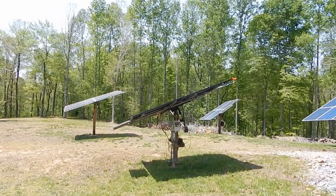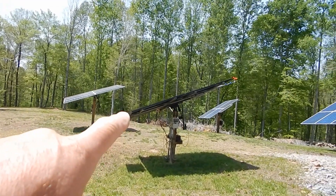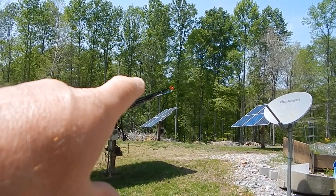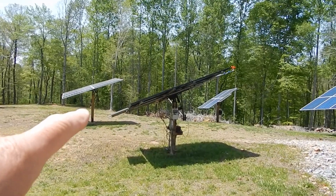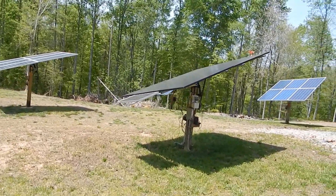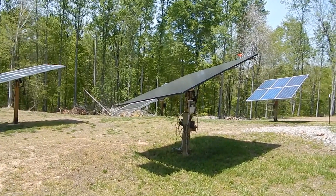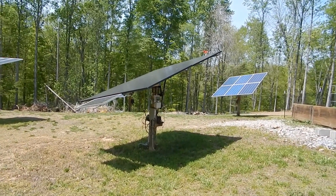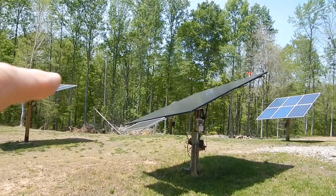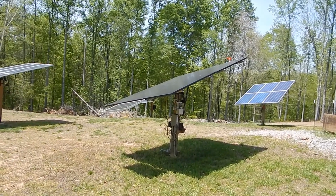I'm going to show you what I'm doing here today - my two solar trackers that I have Siamese with the little relay box I showed a while back. I just replaced my anemometer that I destroyed with the blower. As you can see, the sun's been in and out today. These two solar trackers aren't really synced, and I believe that's due to voltage and line loss depending on the time of day and the state of the battery charge. This unit controls that unit, and as you can see they're at a slightly different angle. On a cloudy day they really get messed up, so I'm going to show you what I have to fix that.